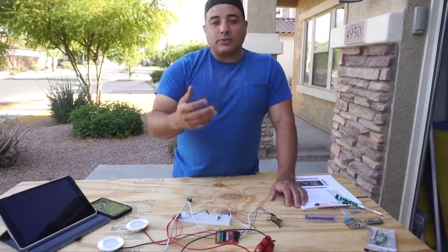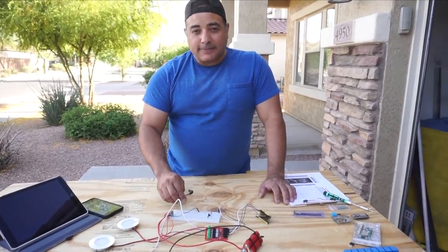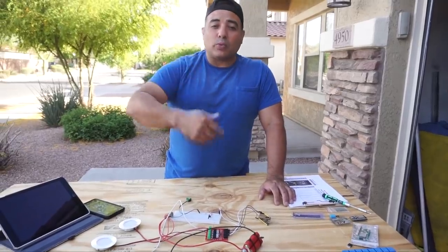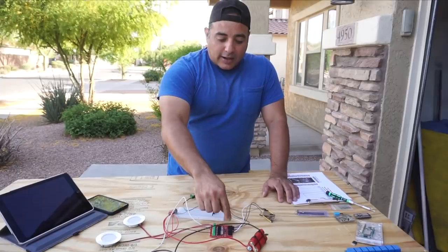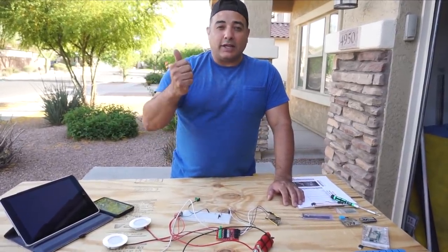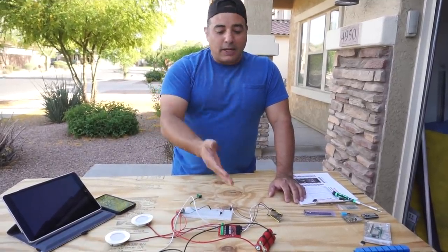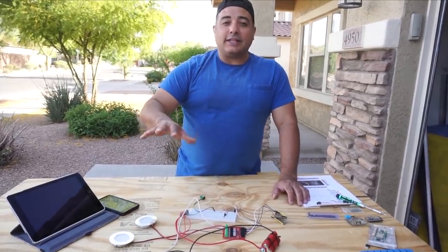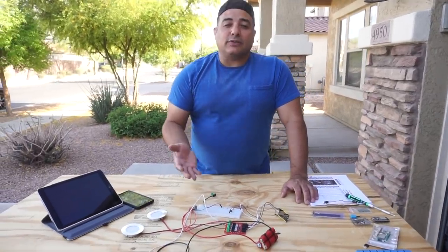And so what we do is, we're gonna run, off of our little 5 volt bus that is generated by our converter, we'll have 5 volts available, and we'll run that to a switch. And then from that switch, we'll run into all the MOSFETs that need to be turned on manually. And so those manual overrides will override any PWM signal, it'll override anything, and just turn lights on. So that's another way we're using this concept of graceful degradation.